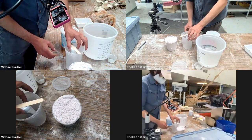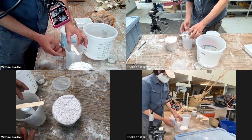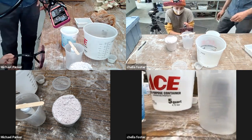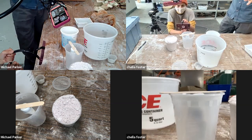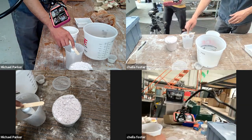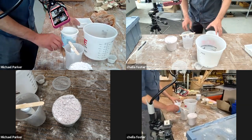Can you explain why it's important that something isn't touching the bottom? What we want to do is make sure we have basically a full mold of this little object. The goal is to get it as clean, simple, and tight as you can, so you're using as little material as possible, but also have a way to pour in our positive material — which is our plaster. This right here is going to be an opening in the mold and we're going to pour alginate right up to the top of that.